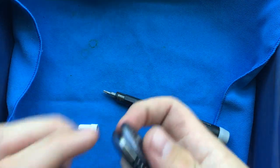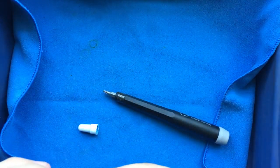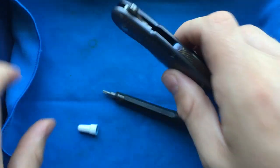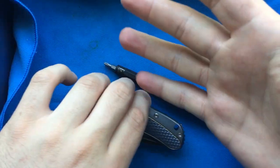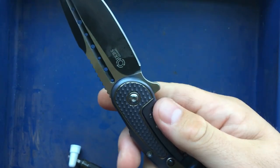And of course, it'll take a little while for all of the blade and everything to just get worked in, lubed up. Oh yeah, this is good. Centering is perfect. That's good. Everything looks the way I started it. Now, the final step in any IKBS build is to look very, very carefully for any remaining IKBS balls. Looking on my tools, on the tweezers, oiler, okay. Gonna go ahead and lift this up. And I believe I saw and could account for every IKBS ball in here.